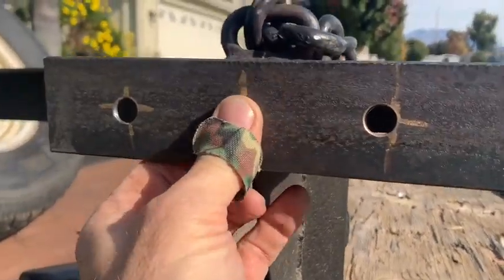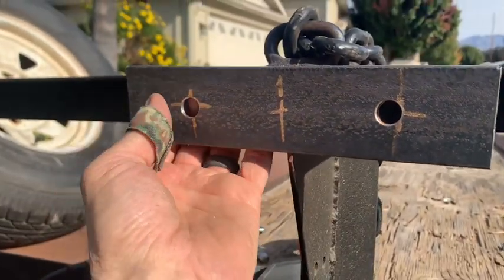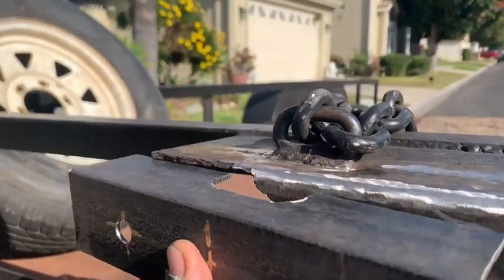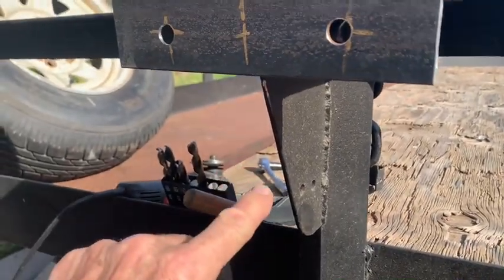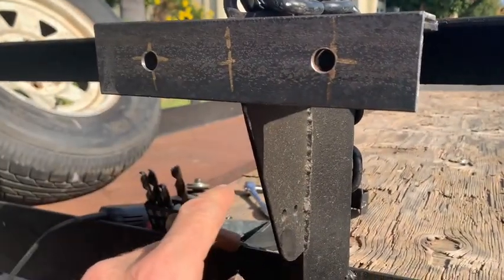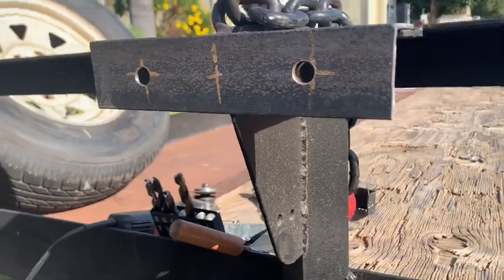We've got our holes in here, got a hole in here that lines up pretty good. I'll put a backer plate on here so it's a little thicker, and we'll weld up here. We've got to come down here with one of the other holes, so let's get this hooked up with the bolts in it and then we can see where the bottom is going to set. We've got this stud set up — going to put a tack on that and see how square it is.